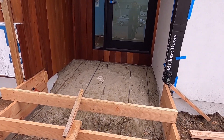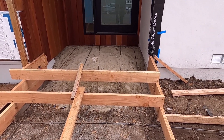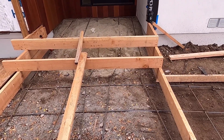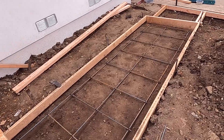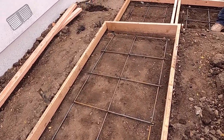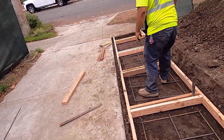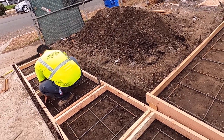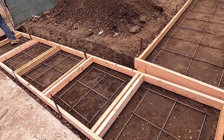Over here I don't need to compact because this slab is too thick. Up there it's about more than 12 inches, and down here it's about eight to nine inches. Since it's natural ground and we removed the dirt, we don't need to compact. We just hold that mound of dirt — it came from this walkway.